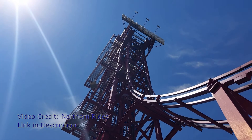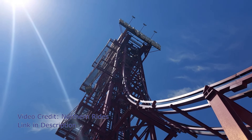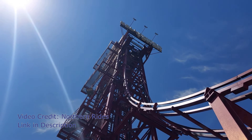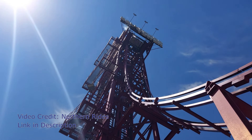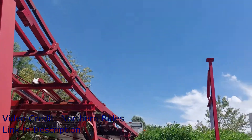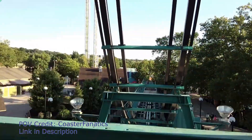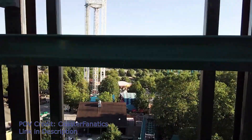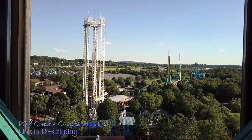These rides were from a time where most engineering was done on paper and manufacturing processes were more manual. The ride structure was built with I-beams, angle iron, and sheet steel — all off-the-shelf materials you can get from any metal supplier. Using off-the-shelf materials means any shop can produce parts using widely available materials. They require little more work than cutting to length, drilling some holes, and maybe a couple welds. Using structural members of standard shapes makes the engineering far easier. They could have created a more sleek and customized structure using fabricated supports like flat rides of today, but that would increase the engineering complexity and cost. CAD didn't really catch on until the 90s, so the engineering was mostly done by hand.